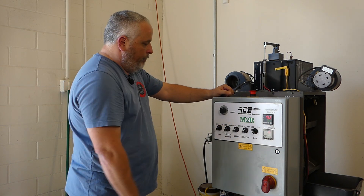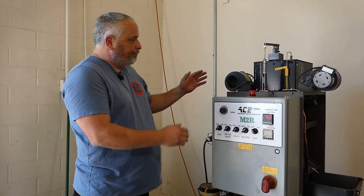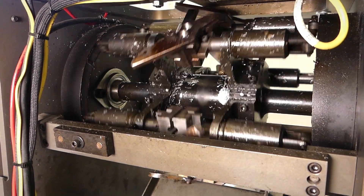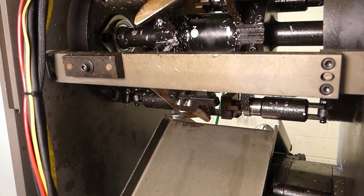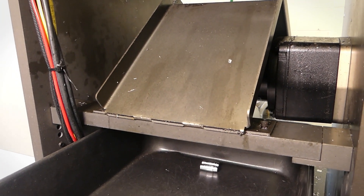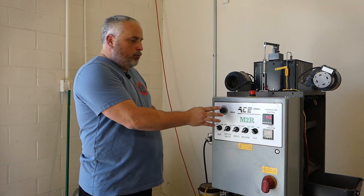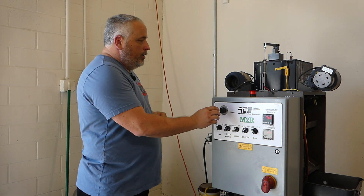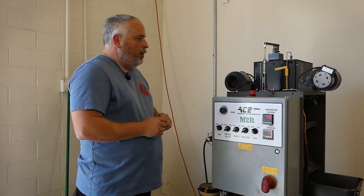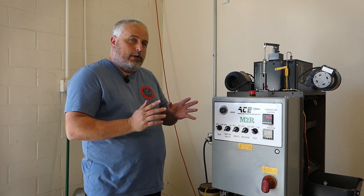If you want to turn a fan on — here's the fan — so after the sprue has been filled with lead and it's coming to the next station, the fan is there to cool it down. Depending on how fast your sprue is going to cool down, you can set the speed of the carousel to wherever you like. Whatever gives you good bullets — you can run at that speed, up to about 5,000 to 5,500 bullets an hour.